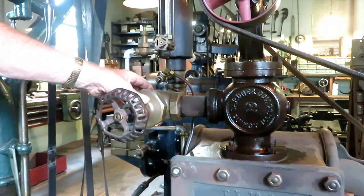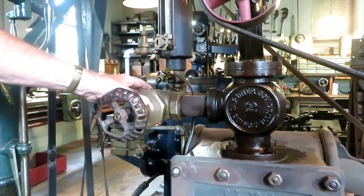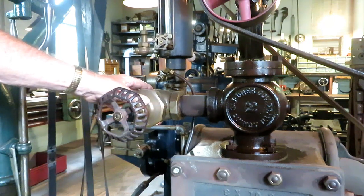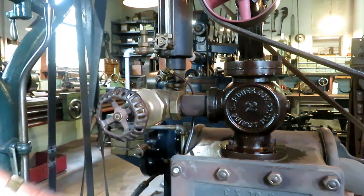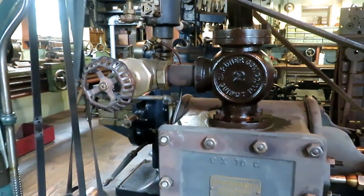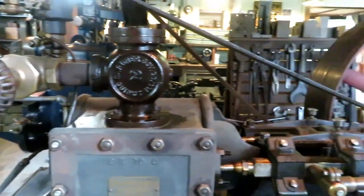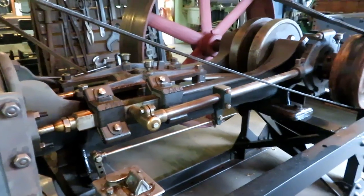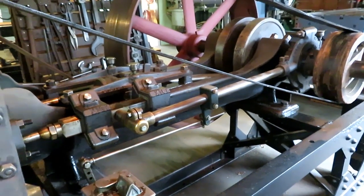And just a drop every minute or so is absorbed into the steam. It runs through the engine and lubricates the slide valves and the piston and rings in the cylinder. The rest of the engine is lubricated by lubrication fittings of one kind or another.